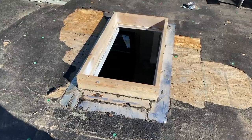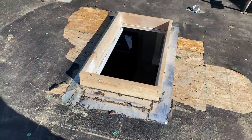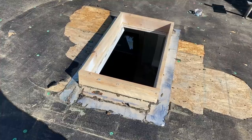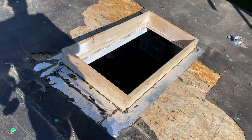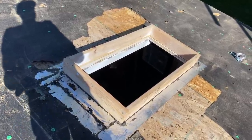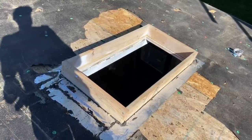There used to be a fireplace in the kitchen here and they had framed around it. You couldn't even see it was there until we peeled the wood back, and we went ahead and took that out and we're going to put a skylight in the hole where that was. For a long time we just had an IKEA bag sitting up in there keeping the rain out, and then when it started to get cold and snowing we installed the skylight. Now I've got that out and we're going to insulate around it and raise that skylight up a little bit.